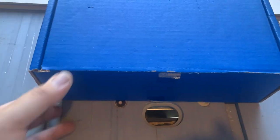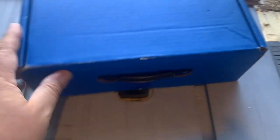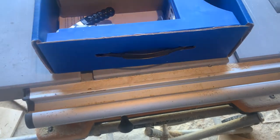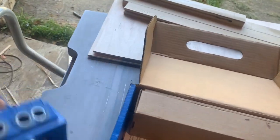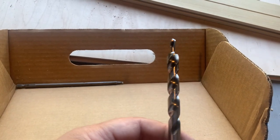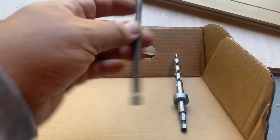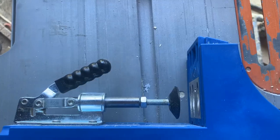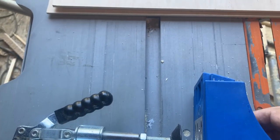It got to be the end of the day yesterday, so I had to — as BE Adventure Partners says — take a nap. Now it's time to put the doors together. We're going to be using the ubiquitous Kreg pocket holes. This is the Kreg kit. Buy the tool — everybody says it, and yes, it costs money, but we've used it so much. This is the Kreg drilling guide, inside is the drill bit specific to Kreg with that little shoulder on the top, and the Kreg screw square-drive bit.